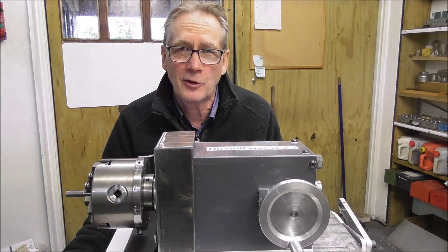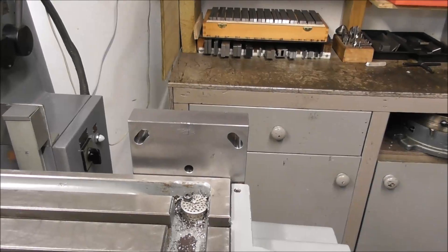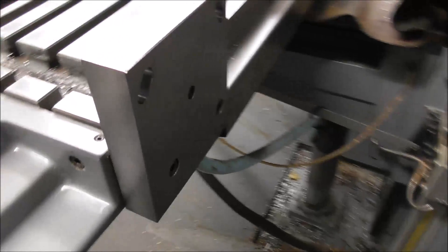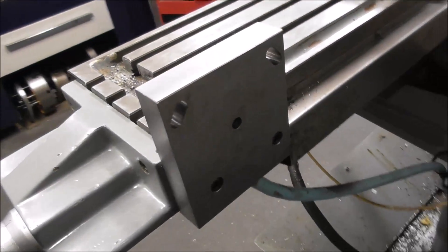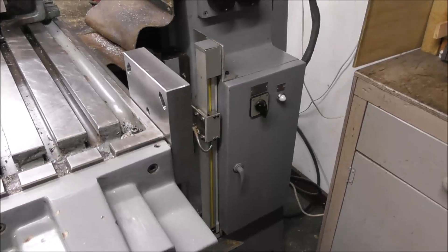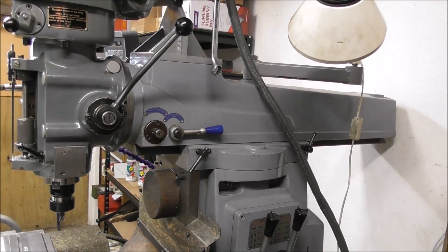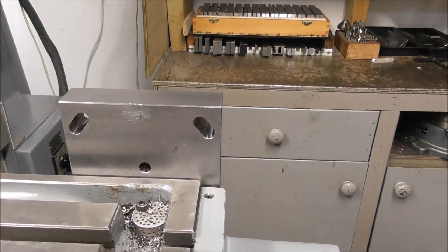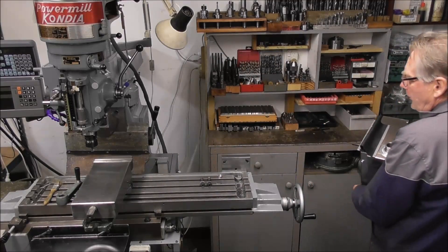New for Thread Express 2.2 is a better design of mounting plate. In my earlier videos I just had an angle plate while working out the best option. I think a permanently mounted subplate, held on with a couple of cap screws pilot-drilled into the side of the mill table, is small, low-profile, and out of the way. It can stay in place and allows you to clip the attachment on very quickly onto a vertical milling machine. Most people will have a turret Bridgeport-style mill that can easily be spun around into this position, and the slotted screw holes allow you to pivot it and set the all-important helix angle.